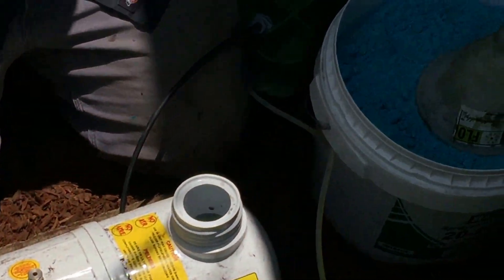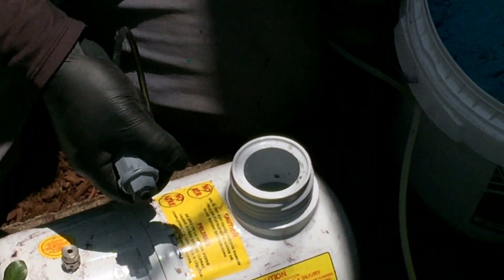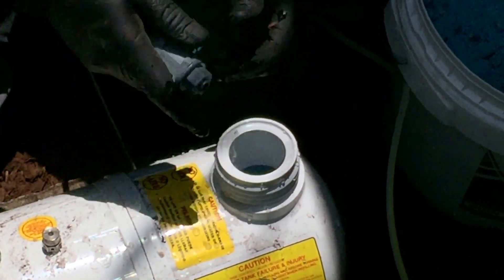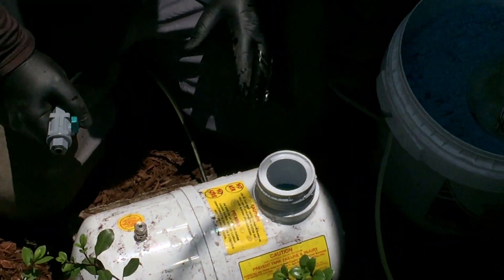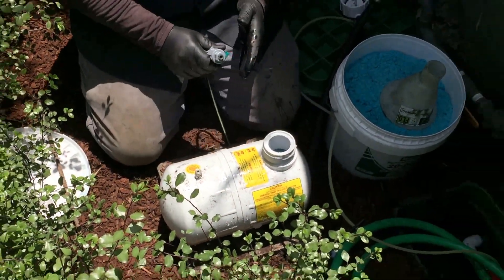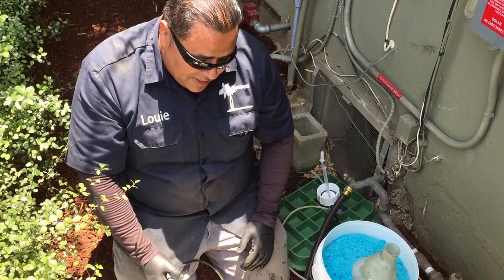Once it is filled, you'll see that blue fertilizer line. The next very, very important step: go ahead and take advantage of the water that is always in these lines here, and we're going to fill this up with water. It is very, very important that you get all the air out of the system. If you allow air to be pressurized in there, it will cause extreme pressure and could potentially blow out some of the gaskets on the tank, as well as the fittings and valves. So we want to bleed all that air out of the line.